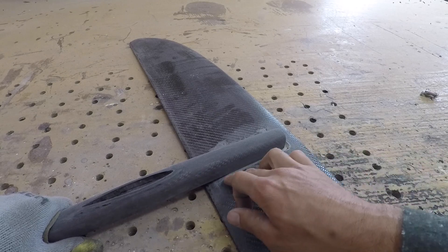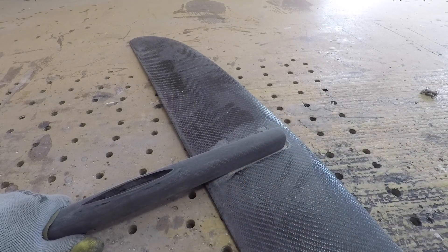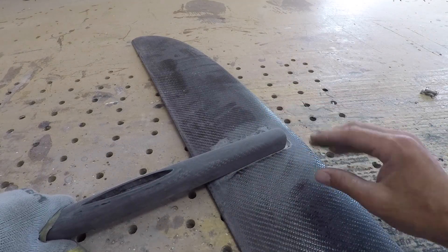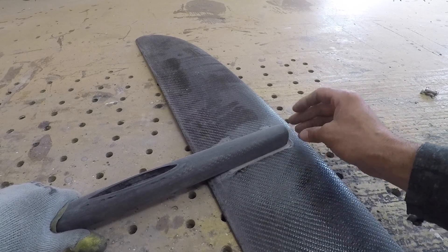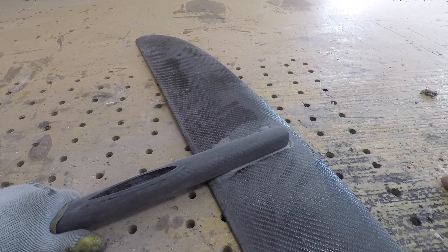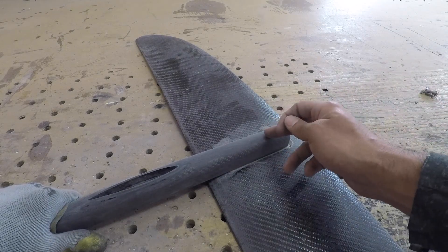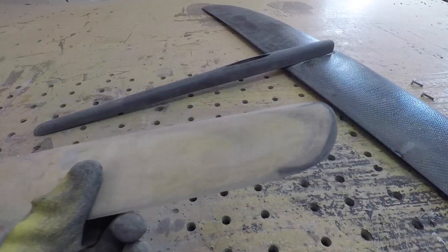When doing the tunnel it's a two-part process. First you fill in the sides and get a little bit going up front with thickened epoxy, let that set up, then pop the fuselage, sand things smoother, and finish the tunnel with more thickened epoxy and actual layers of glass. The reason you do it in two steps — I learned the hard way — if you do it in one step, particularly up front where you need a good amount of epoxy, it builds up too much heat. That heat somehow melts away the release wax, and then the fuselage ends up bonded to the tunnel and it's basically ruined. Two steps keeps the heat down.